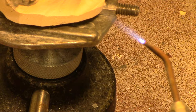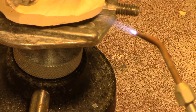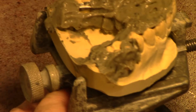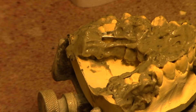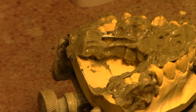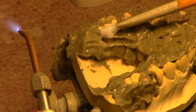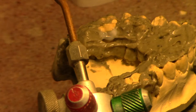This torch gets up to a little over 5,000 degrees — I don't want that. Now I'm going to heat up this flux; it's a boric acid based compound and I don't want to breathe the fumes, so I'm going to put a fan on low to draw the fumes away. I've got a clean brush and clean flux. I'm going to heat this up just a little bit, put the flux on — it kind of sizzles and goes in there. Now I have flux over the area and I'm going to sweat it.